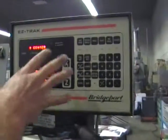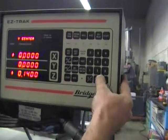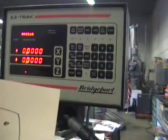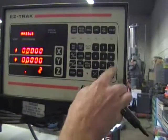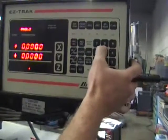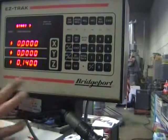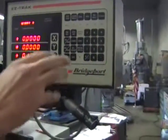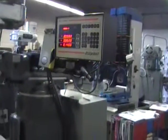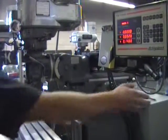This is my starting position and I'm just going to go zero on both X and Y. It's asking me for a radius — how far apart I want them. I'm going to say two-inch radius. And my starting angle — I'm going to start it off at 45 degrees. Once that's all programmed, all I have to do is hit the start button, which is going to hold it for three seconds. It's asking me to check my Z axis, which it's up because the table is going to start moving.